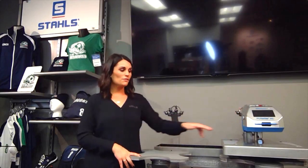Let's cover the Dual Air Fusion — the true Cadillac of presses. It's almost identical to the Air Fusion except it has two pressing stations. The head comes over and can print on both sides. While one side is pressing with your shirt loaded, you're over on the other side loading the next shirt. When the timer is up, the head comes over and presses the second shirt, and you take the first one off. You're pressing two shirts in the time it traditionally takes to press one — amazing for production efficiency.